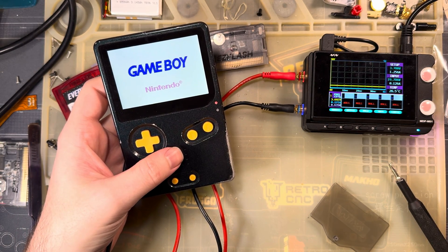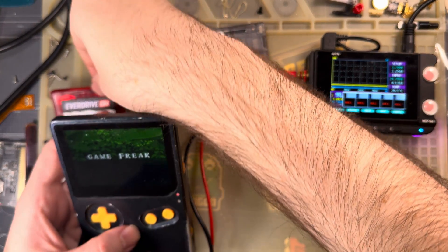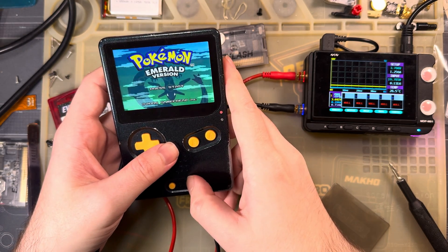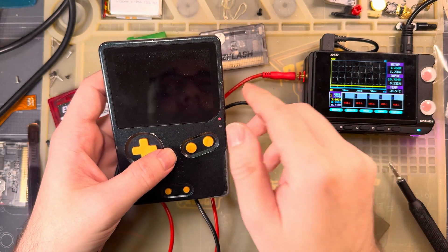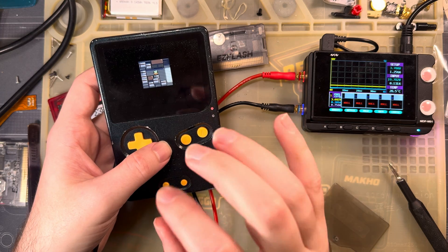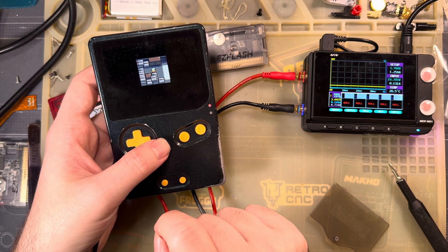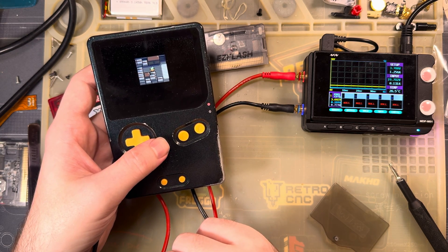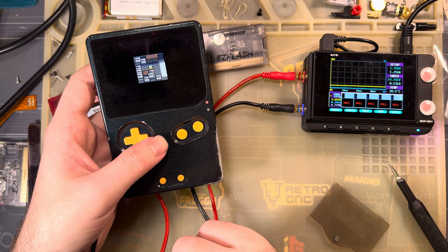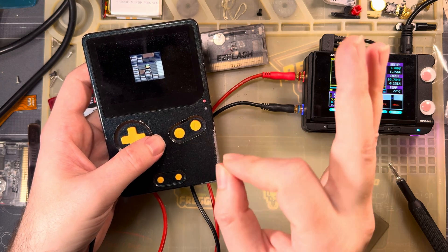One thing of note: I'm using a different SD card for testing today than yesterday. On this Omega Definitive Edition I was using a SanDisk Ultra, whereas today I'm using an A-Data card. It shouldn't make that big of a difference, but it might, so let's rule it out. In mode B, we're just a skosh higher than mode A NOR flash - basically the same, negligible - I'd say 197 to 202 milliamps. Sounds reasonable.